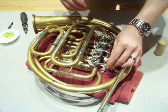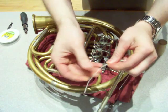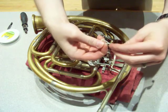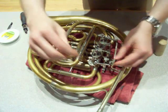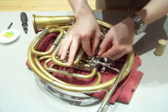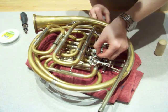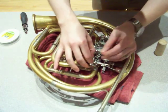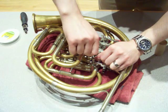This was covered in a previous tutorial, so I'm going to do this fairly quickly. I've got a length of Dacron trolling line cut already. We're going to tie several knots in the end to keep it from slipping through the hole in the middle of the lever. Go through just like that, around the opposite side of the stop arm. Loosen our valve lever screw, loosen our stop arm screw. Go around in a figure eight, and snug that screw.